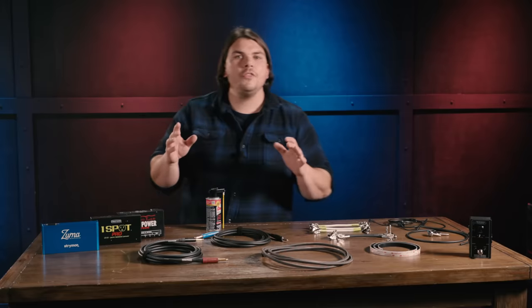If cables have to cross, you'd want them to do it at a 90-degree angle — so you'd have power going one direction and audio going the other direction where they cross. For pedals, for the most part, we're dealing with fairly low voltages, so the necessity to do this isn't an absolute must. Don't feel like you need to bend over backwards to do some crazy routing. But where you're able to isolate the DC cables from your audio cables, you want to make sure you're doing that as often as possible as a best practice.